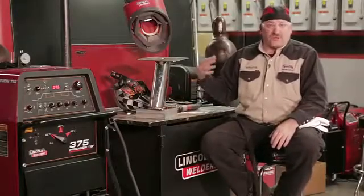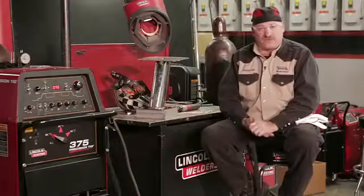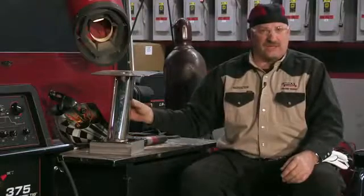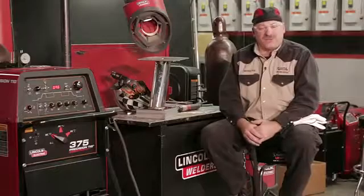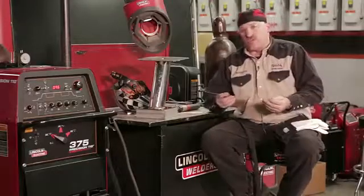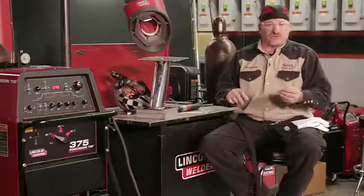As you know, there are a lot of different kinds of stainless. This is called an austenitic stainless — it's a non-magnetic stainless. The base grades have about 18% chrome and 8% nickel, but they vary the chrome and nickel content depending on service conditions. This happens to be 316L stainless, which has a little more nickel but also has molybdenum added. Anytime you're within five miles of the coast, they recommend 316L stainless because of pitting corrosion. It's also used in industrial applications with chlorine, chlorine in swimming pools, and food grade applications because certain acids in foods will actually pit stainless steels too. So this is a better grade of stainless than what your kitchen sink is made out of. I used a 1/16th 316L filler wire and kept the weld size as small as possible to avoid distortion.